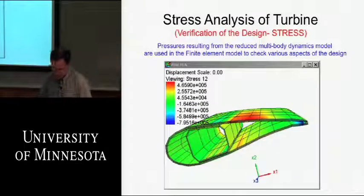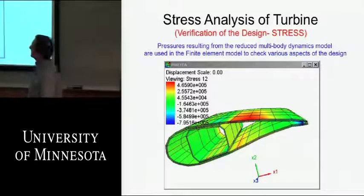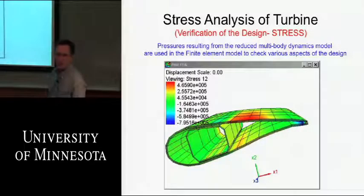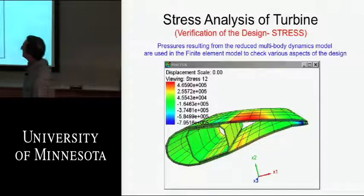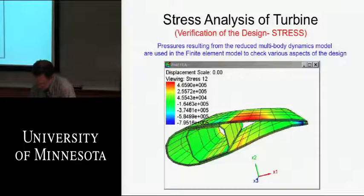Another example is this. This is a section with the spar, 1 and the 2. So this is one box within another box. And this is for some loading condition and some fixed restraint conditions. This is the level of displacements at certain points. So you can see that there is something going on where this red area is comparing to the remaining part.